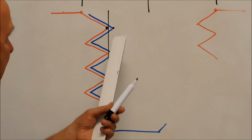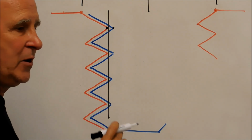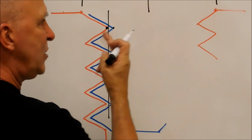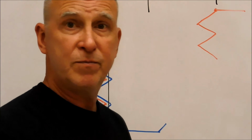I'm going to drill down through it. I'm going to create a spring on the inside. And the only danger that I can tell you about doing something like this is take your time. You do not want the remaining spring to wrap around the drill or engage the flutes. That's a danger when you're doing this with an end mill, like pulling out a tap.